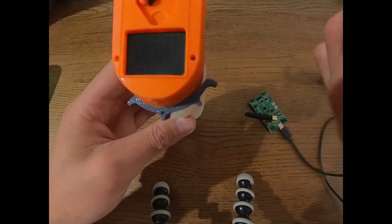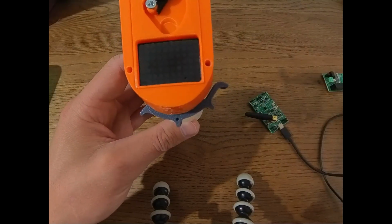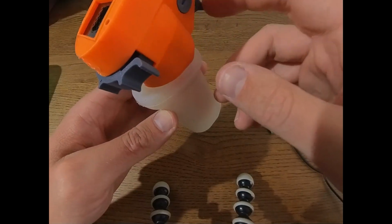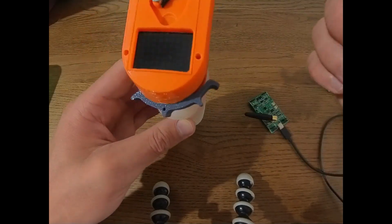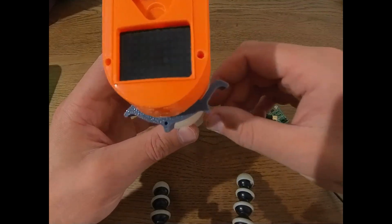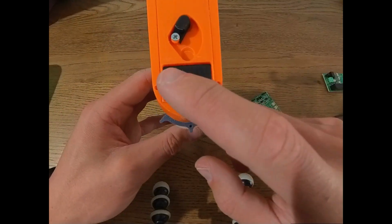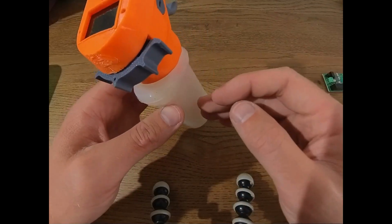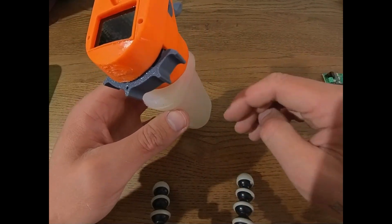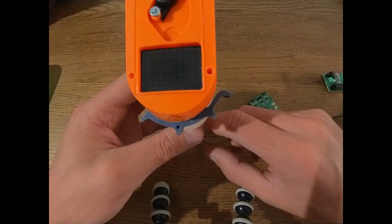Now, after we've done all of this, it's going to either show us EC, which means error in calibration, which I'm actually going to simulate by not pushing the trigger in the first try, or it's going to tell us save, which means everything was okay and the configuration has been saved. Now, if it shows us EC, it helps to actually connect the remote to USB, which I'm going to show you later, to a computer to see what actually was the problem.